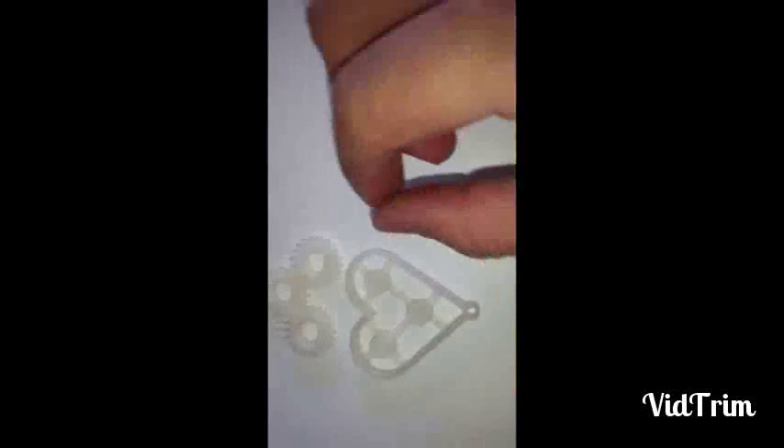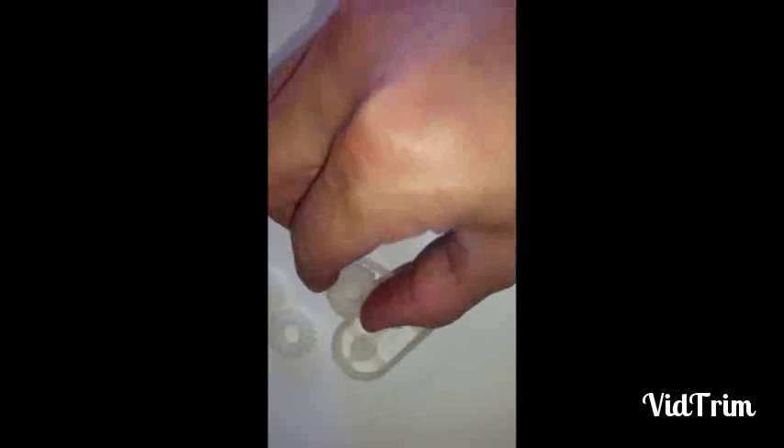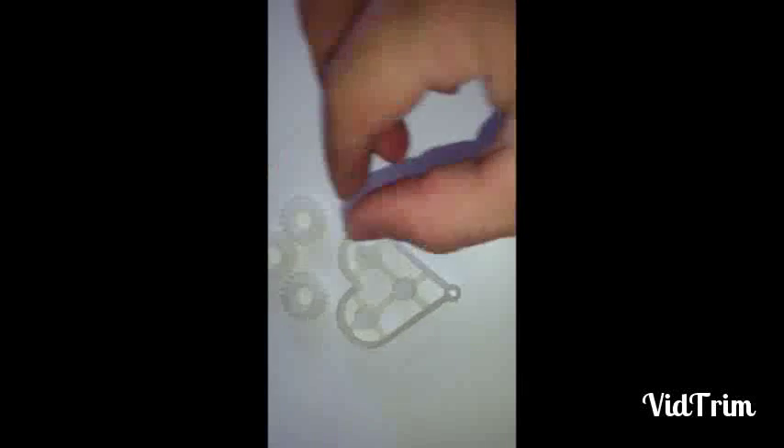Here's a pulley that actually turned out pretty well — that is no infill, just thick walls, medium print resolution, and it's actually pretty tough. Don't really see any issues with that. This geared heart also seemed to come out pretty well. Those are supposed to snap on there but I can't force them to snap, at least not without pressing so hard that I think it's gonna break.